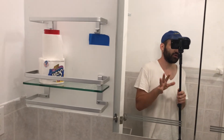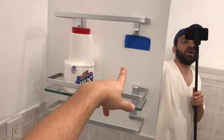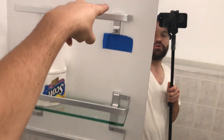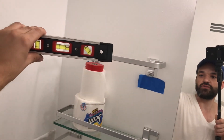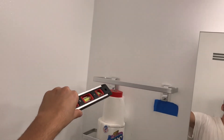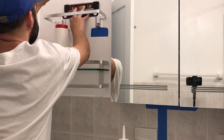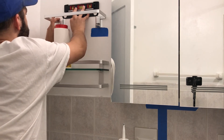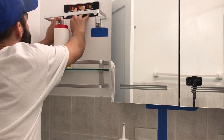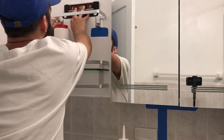You don't know how old the house is, and I want the screw to fit tight without cracking the wood — because then the repair is a mess. I already leveled this bracket out — put the level on top of it and it's perfect. Now I'm going to level both brackets to the same height and then drill the hole to mark it. I'm going to use toggle bolts for this side. We're going to have it just like that, nice and level. Pre-drilling that hole, taking everything off, and finishing up.